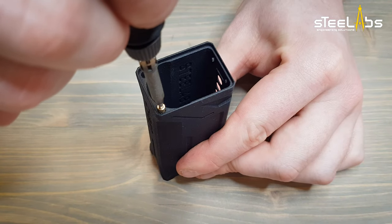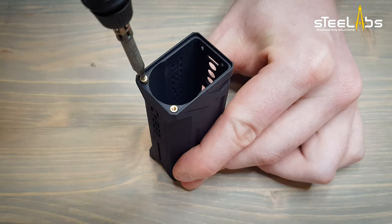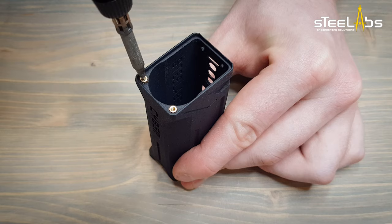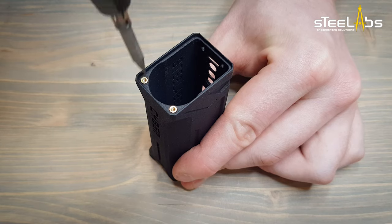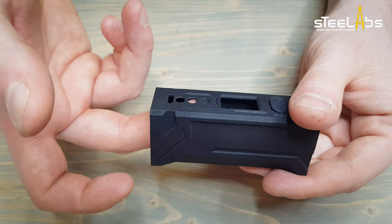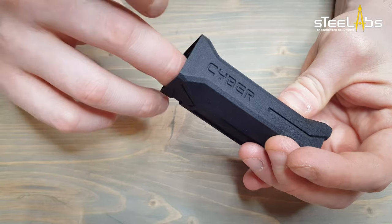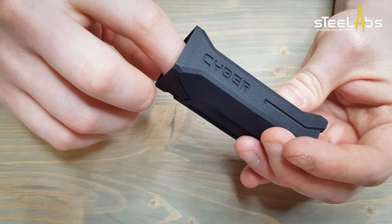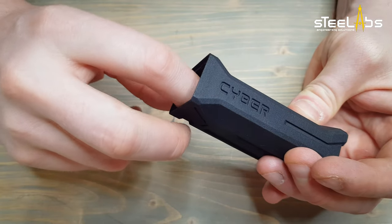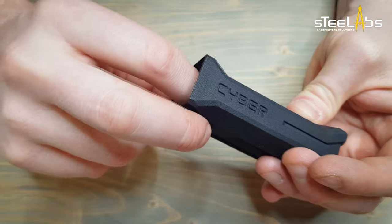This time I'm using the iron solder tip to get the inserts into the body. I wouldn't recommend it though. This process is easy to mess up. Place the buttons in the body. Flip the body to prevent them from falling. If they don't fit, use sandpaper to widen the button hole and a marker to blacken the sanded areas.